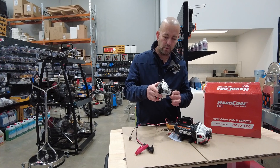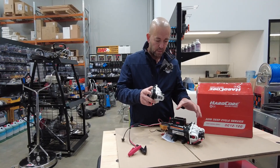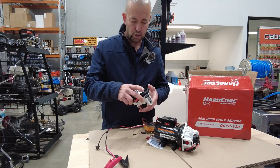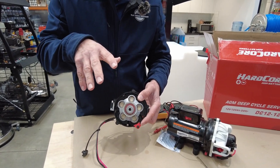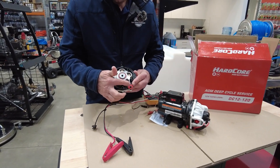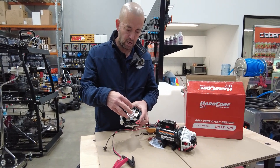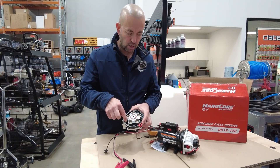These particular cartridges are available as a spare part on our website at bluetongueindustries.com.au. The pumps are designed with a fail-safe system built in, and they have a red light on the top. The red light is connected to a leak detection system sitting at the bottom of the pump. The pump orientation needs to be correct, so when we install the pump the switch needs to be upright, which puts the leak detection system at the bottom of the cartridge.